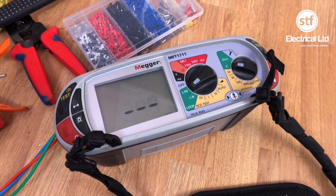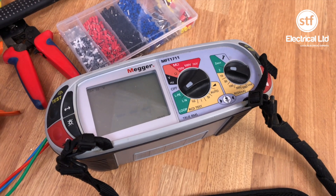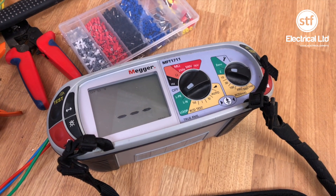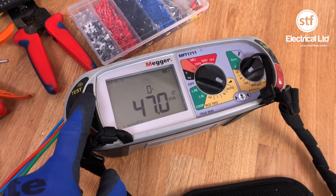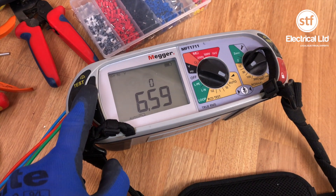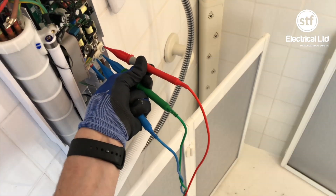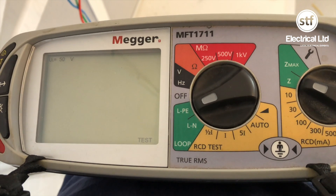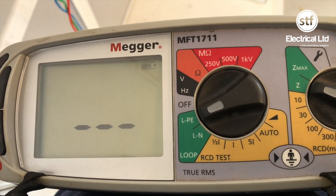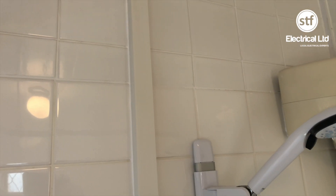You'll see us getting the Ze now. This system is TN-CS and I'm getting about 0.17 ohms here, which is more than permissible for the type of earthing system we've got. There it is — 0.17, like a mystic Meg. And there are our RCD readings — the circuit is protected by an RCD, and those readings are more than permissible. Didn't get a video of the R1+R2 reading, and the ZS reading will be slightly higher than expected because there's impedance on the load side of the RCD adding to the circuit — so R1+R2 is much lower than that.